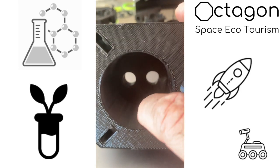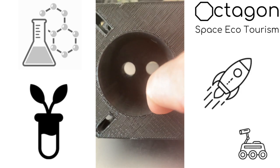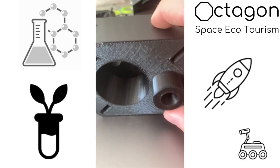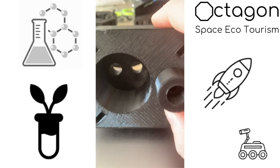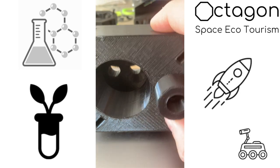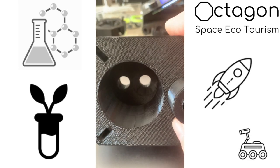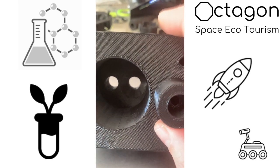So building cylinder walls, anything cylinder, motor, pump or whatever, Tinkercad breaks everything down into a bunch of 64-sided shapes or polygons. It's actually not a perfect circle. And again, we can sand it down to try to get a nice tolerance and everything else to try to create pressure. I just want to use TPU, again, to not have to do any sanding, stick it in there, and we're going to get friction.